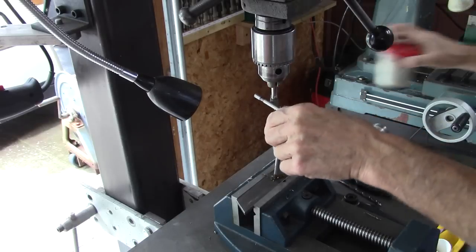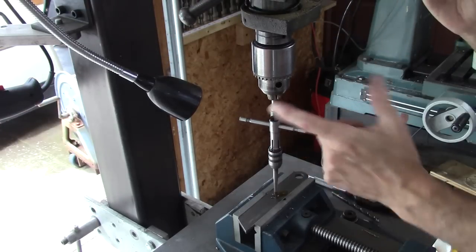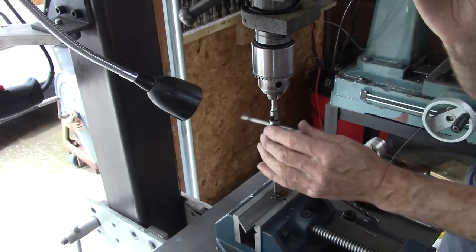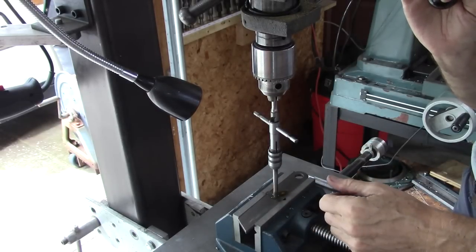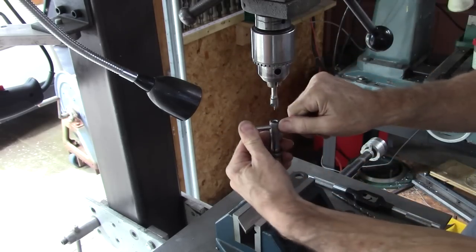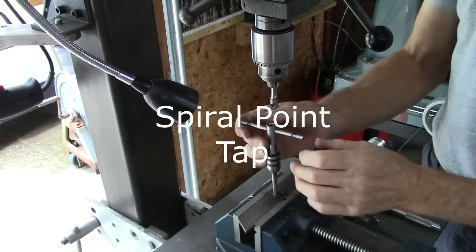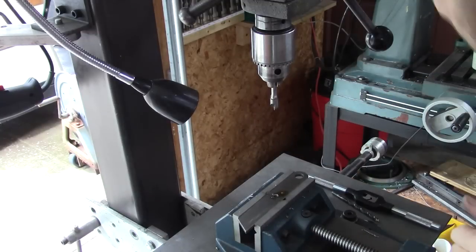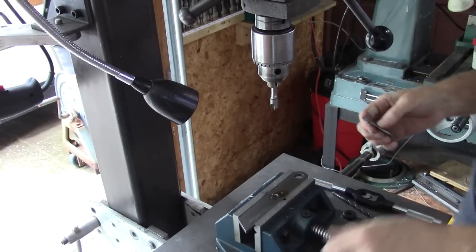Now a little oil. This keeps everything aligned. A lot of people use a spring-loaded tap guide, and that's probably a good idea, but I've got the countersink in there already, so I generally wind up using the countersink. That's requiring a lot of effort right there — would be nice to have another hand for the drill press. This is a spiral tap so I don't need to back up. Anyway, I just tap that hole. But if I'm doing a whole bunch of holes that gets really old, and my hands start to hurt from the lack of leverage.